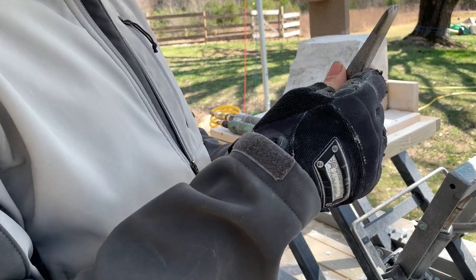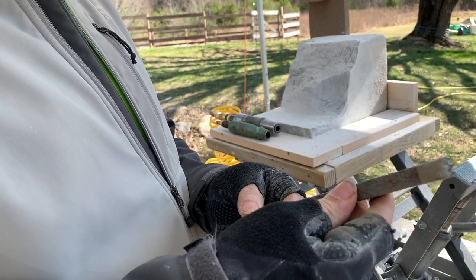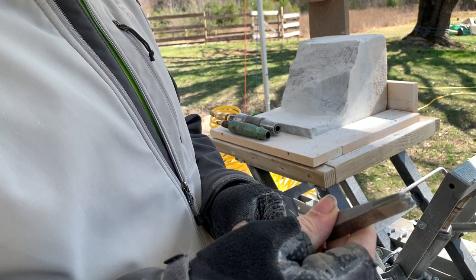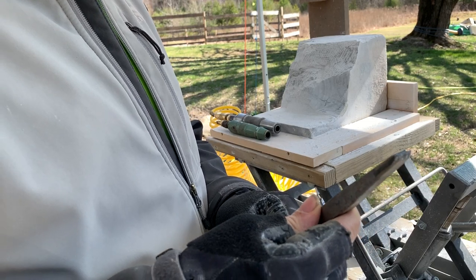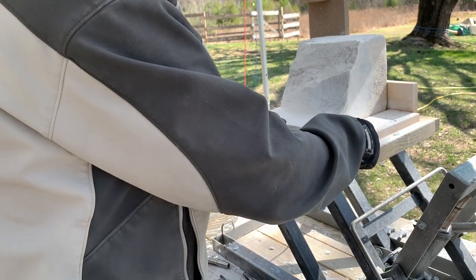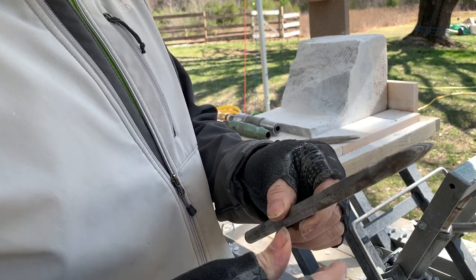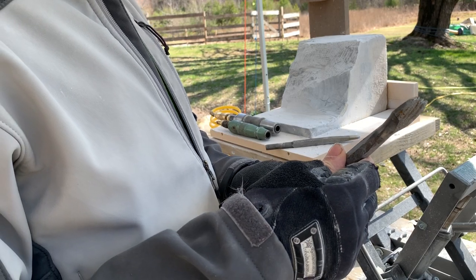These are the chisels. This is a 3-tooth pointed chisel. This is also by Trow and Holden in Barre, Vermont. It's got a carbide tip. The three points are carbide. And I use this for sort of fast removal of stone with a 3/4 inch hammer. There's this, which is a 1-inch 3-tooth chisel, which I would also use with the 3/4 inch hammer to remove a lot of stone.